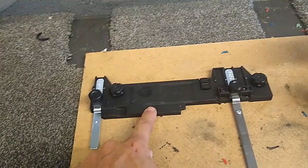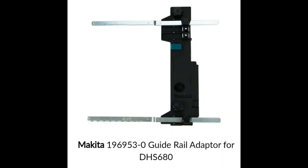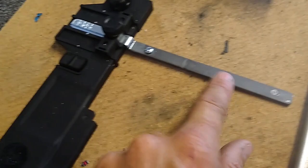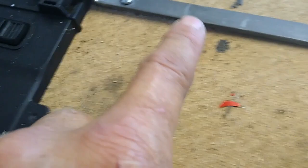The adapter for this saw isn't available, so I bought this on a punt thinking it's only the length of these wings that's different. The original leg was the same as this — you've got one at the front and one at the rear. I don't purport to be a welder, but I've got some bar material that I had already and I've welded it onto the end, basically extending the original leg into the longer one.